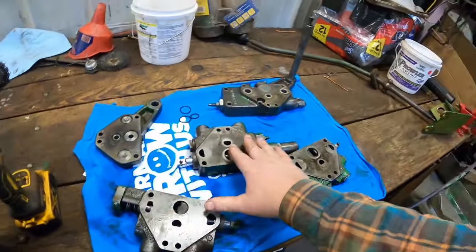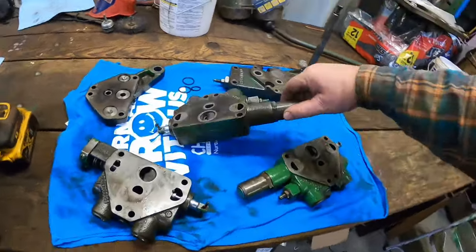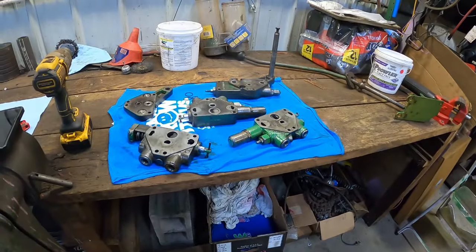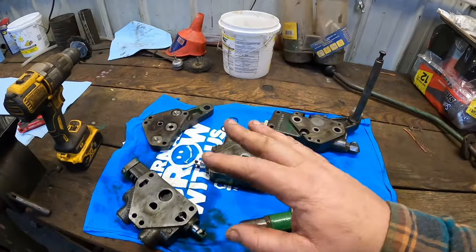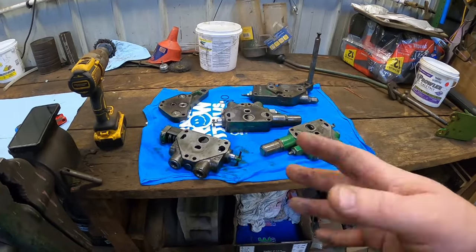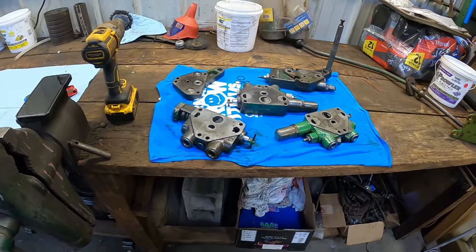It's simpler than these other detent-style valves, so we'll start with that. Also, this was a two-valve tractor before. I got another valve off eBay, so now it's going to be three. According to the book, it is not possible to have three valves on a tractor with ROPS, but I've seen it done and I measured it — it will fit. The problem is you've got to get them on before you put the ROPS on, because once that's on there's not enough room. So if you ever have to service them, you have to pull the ROPS off to do it. But it is possible.